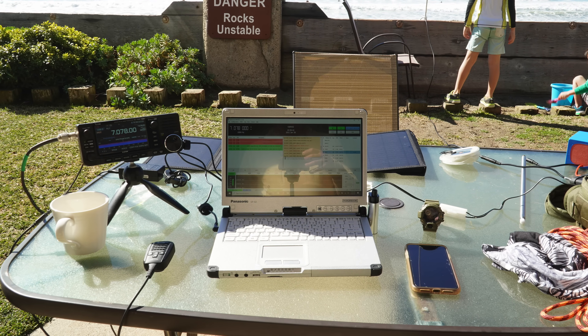So what do I think of the Wolf River? I think once you understand what it is, it can be an effective antenna. With this whip, I'm able to do Winlink email, JS8Call on Winter Field Day, and make phone contacts fairly effectively — even at the 10-watt output I'm using with the ICOM 705. The thing to keep in mind is you're going to be adjusting the collar up and down the coil to find the resonant frequency. You'll be doing that a lot if you want to change bands. On 20 meters, 10 meters, and especially 80 meters, you're going to be moving around quite a bit.